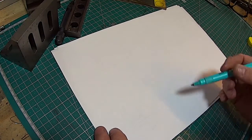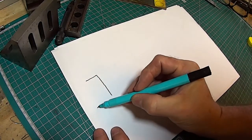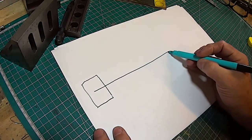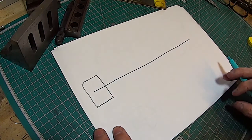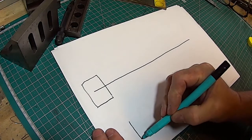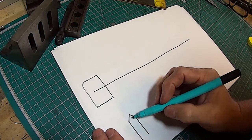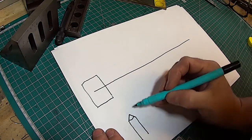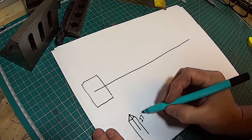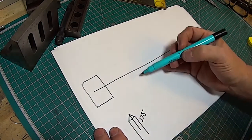Just to clarify what I put in the video, I'll put some of it down on paper. Imagine this is your chuck and the axis running through the bed of the lathe is the axis you're going to be cutting on. When we look at the shape of our cutter — in this case a Whitworth which is a 55-degree angle — we're looking for the half point of that, so 27.5 degrees.